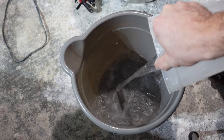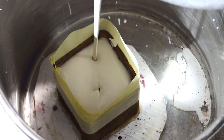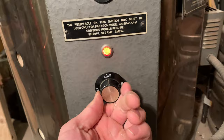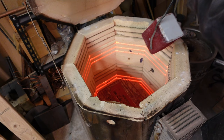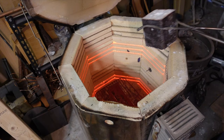Let's invest it. Once all the wax and PLA is melted out and burned out, then I need to blow out the ash. For that I take an air compressor and I lightly blow out all the sprue holes, all the vent holes, and try to get any ash left behind out. Then I put it back in the kiln to heat up to pouring temperature.